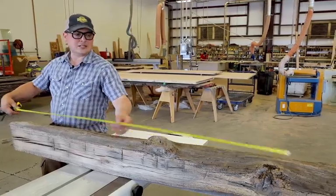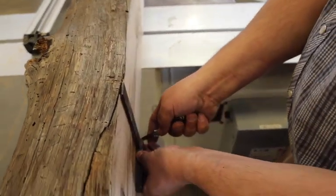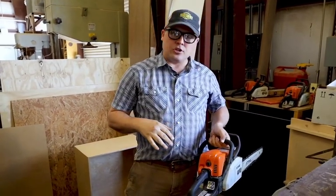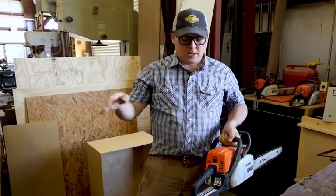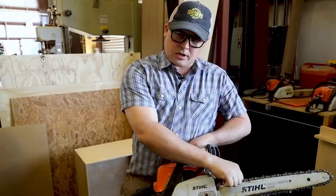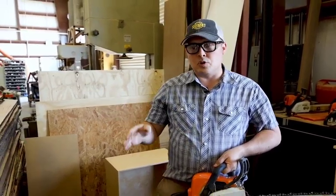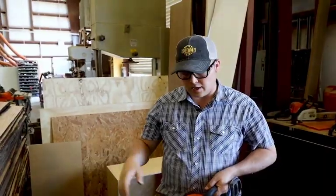Using the flat point on the back side as a reference, I'm going to cut myself a line so I can see it for when I'm chainsawing. It's really, really important when you're using a chainsaw to make cuts that you use a brand new blade, especially in something like oak. I want to cut through this and keep it really straight. We're going to cut through this with a brand new chainsaw blade. I'm going to eyeball it — I'm good at this. When you're using a chainsaw you don't want to force it too much or you'll end up with a bunch of drift. I'm going to cut through really nice and easy to get a super straight cut on the edges.